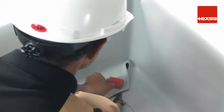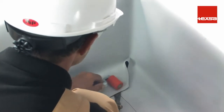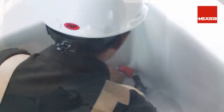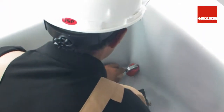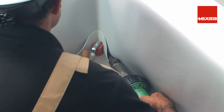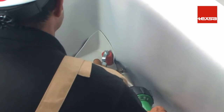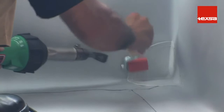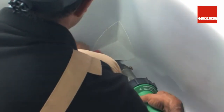Next, close the fold and weld it from the inside out. Take special care along the vertex. Position the prefabricated corner — the installation is much faster and simpler using prefabricated corners. In the absence of a prefabricated corner, one can be made by hand from non-reinforced membrane.